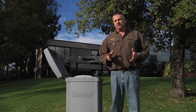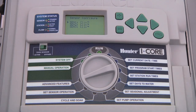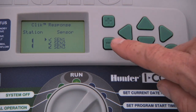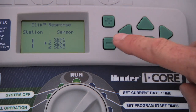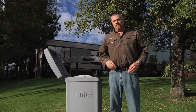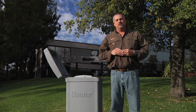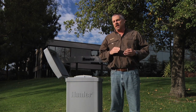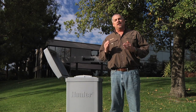Once we have configured our click type sensors, we can now tell the controller how we want it to respond to each one. We do this by turning the dial to set sensor operation. A check mark by the sensor input indicates that the station will respond to the click sensor and shut down irrigation when needed. A blank line indicates that this particular station will ignore the status of the sensor. The default setting is that all the stations will respond to all the sensors, but you can set that individually. So let's say stations three and four do not want to respond to the rain click, but they do to the wind click. We can set them individually by station so that they'll respond accordingly.